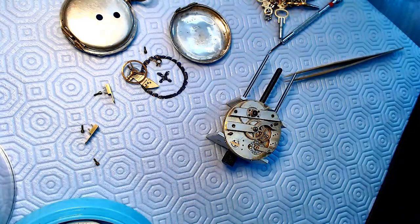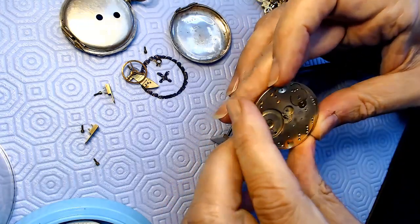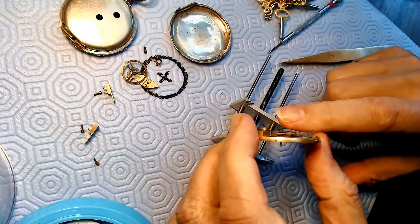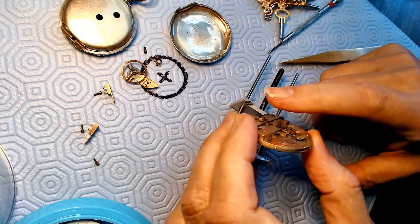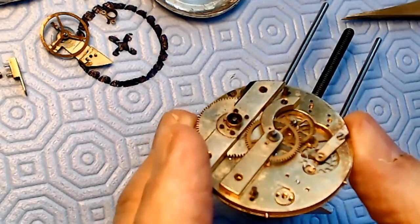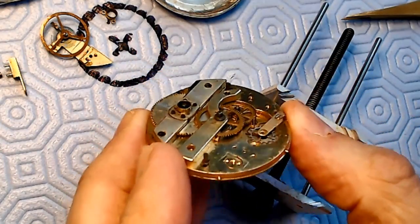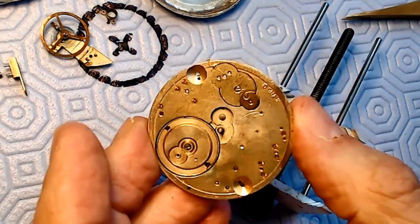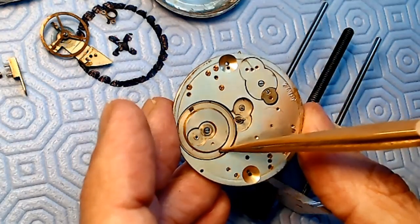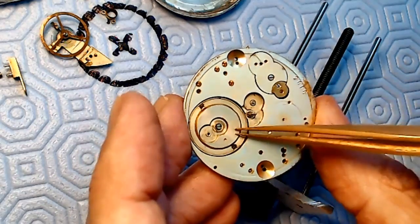This is the tricky part with these old watches - I haven't done a lot of these vintage ones. I think there's a cannon pinion on one side and I've had to tap the end of it at times to get it through. If I zoom in - so that's the movement there. The cannon pinion is on the other side. The weird thing about this watch is that there's nothing below the barrel where the mainspring is - should have been a clip or some gears or something in there. I'd have to ask around to find out.